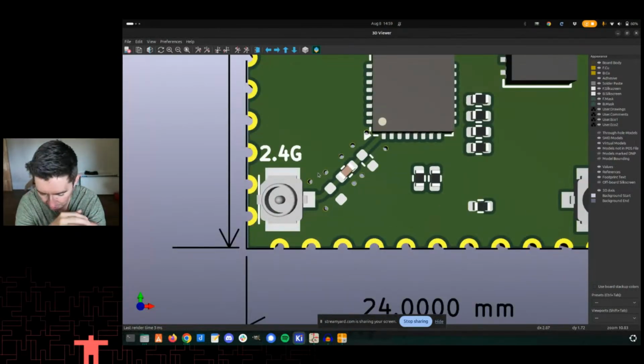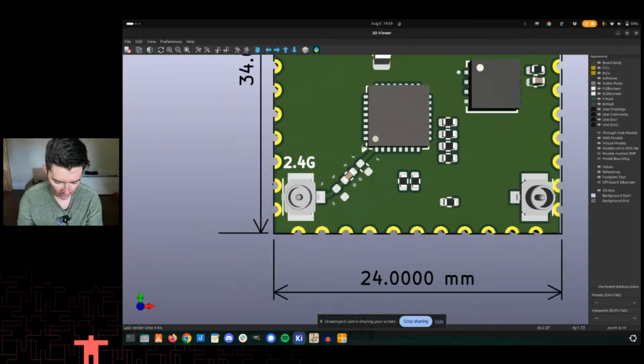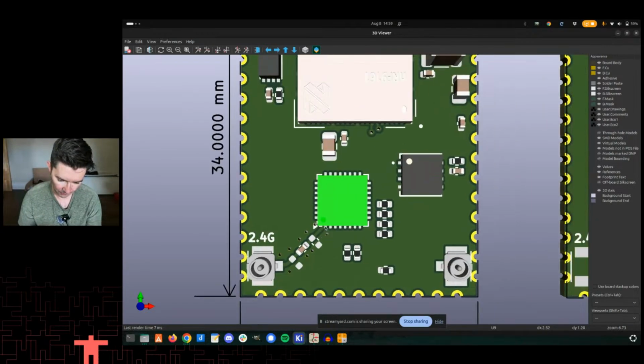I think those vias are not optimized for the process that we're going to use. So we can get smaller vias and get them closer together and tighter, that sort of thing. But ultimately, this looks like an okay feed line to my eyes. So it flows out from the ESP32 out to that center terminal, out to a UFL connector, either UFL to SMA or UFL directly to like a flexible antenna, and away we go.